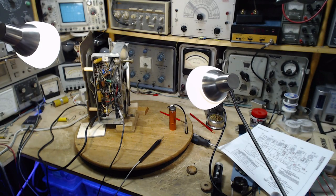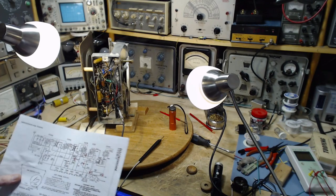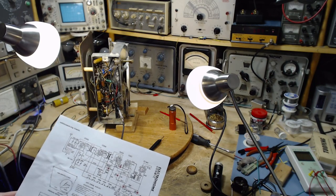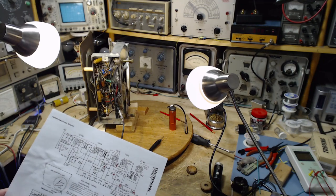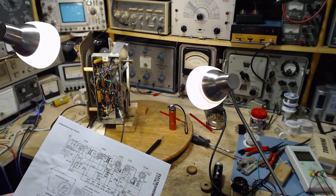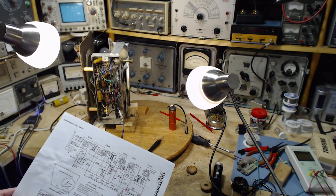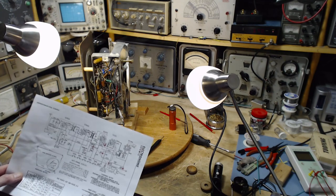Hello and welcome to my shop here on December 19th - Christmas is just a few days away. What I'm going to do today is change a few more old capacitors in a fun and interesting way. I want to focus on the detector circuit, the detector tube capacitors related to it, and the AVC system. The first thing to do is find out a little more about how the radio is operating before I get going.